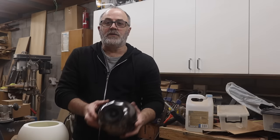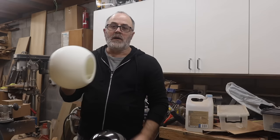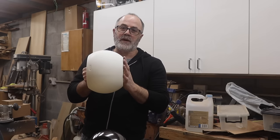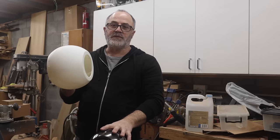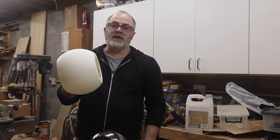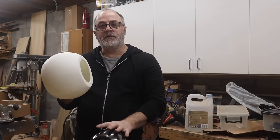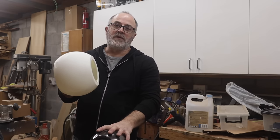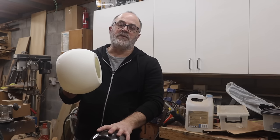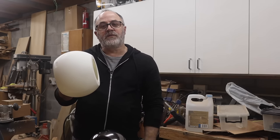And I think it's going to work very well with these eyeball 3D printed speakers. I'll still be using the Arylic 2.1 amplifier together with the desktop speakers and this subwoofer. And we can then also use the DSP function to create a suitable crossover point between the subwoofer and the desktop speakers. And then we can further use the DSP to tweak the overall frequency response so we can get that as flat as possible across the frequency range.